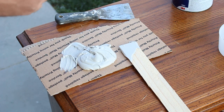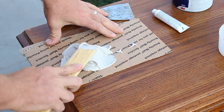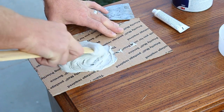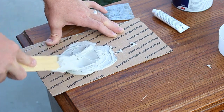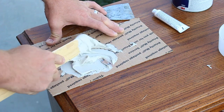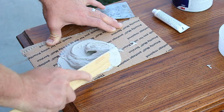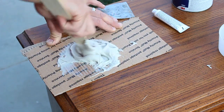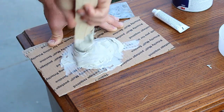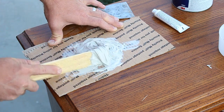I'm going to use the hardener — just a big glob on there, that's probably enough. You want to mix it really well; it does dry pretty quick once the hardener is in. You have a limited amount of time to work with it, and if you don't get the hardener mixed in really well, it won't cure — it goes gummy and just doesn't set up. Bondo can be used for anything: filling holes if you're replacing hardware, fixing damaged parts. It gets really hard, kind of like cement but a little more pliable — hard, durable, and sandable. You can't stain it but you can paint over it. If I have a wood chunk out on a pine leg, I'll use this to fill in the crack — it works great.